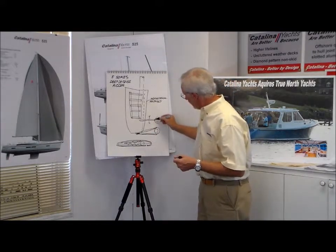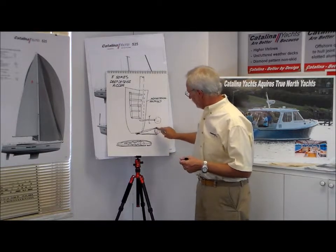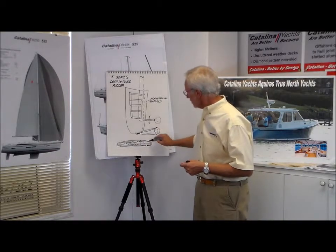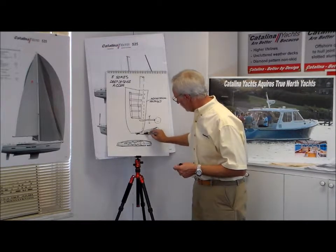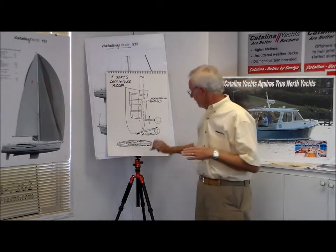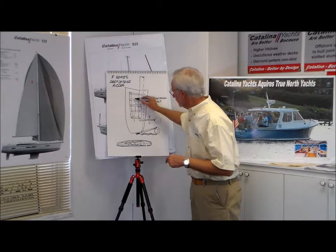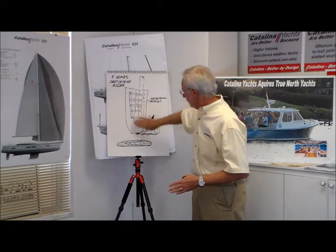We don't have a vulnerable weld right on the rudder blade itself. When we put this rudder weldment inside the rudder skins, we heavily glass the side in contact with the major skin. We heavily glass that with what we call horse hairs, which are long glass fibers. We weave through that part of the weldment until we achieve a good attachment to the blade on the opposite side — maybe a big bundle of these strands attached to the major skin.